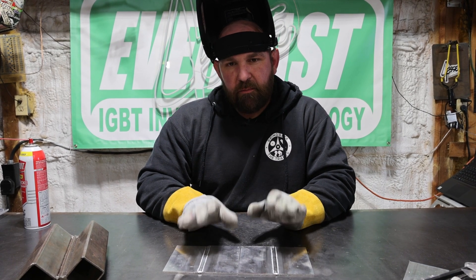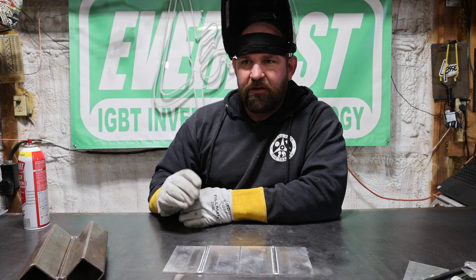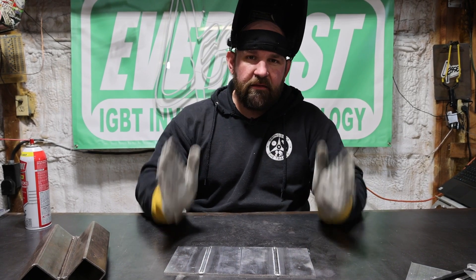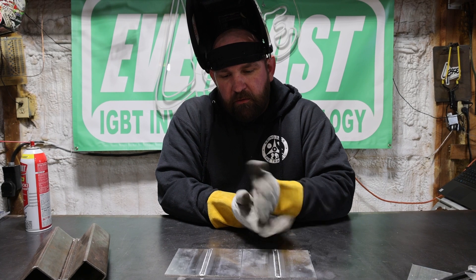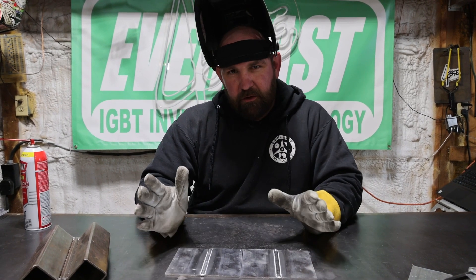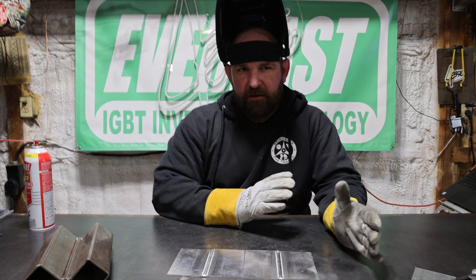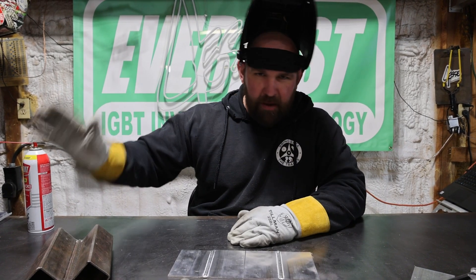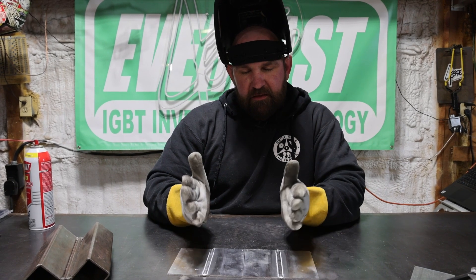The main thing I want to show you is: don't get hung up on machine settings. There are some settings that are wrong — you wouldn't want to run 5% balance or 90% balance — there's a range that works well, but there's no perfect setting. It depends on your cup setup, your tungsten size, and the actual weld joint you're doing. On Facebook, Instagram, TikTok, somebody runs a good weld and there are ten to twenty comments asking 'what are your settings?' — and that's exactly what I wanted to address. It's not gas flow, not cup size, not tungsten size, not balance or frequency.